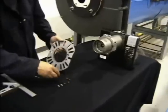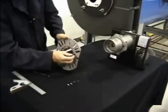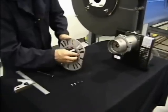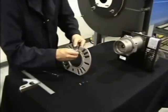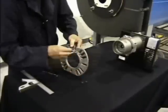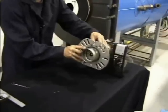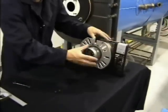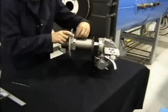Next, prepare the flange by inserting the two bolts through the recessed holes in the flange so that the hexagonal heads are flush with the flange surface. Secure the bolts in the flange with the two chrome nuts supplied. Mount the flange onto the semi-flange by sliding it over the air tube and inserting the flange bolt ends into the upper two holes in the semi-flange. Secure the flange to the semi-flange using the two remaining nuts.